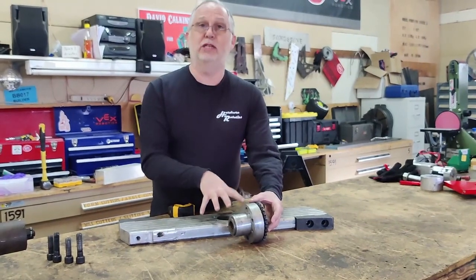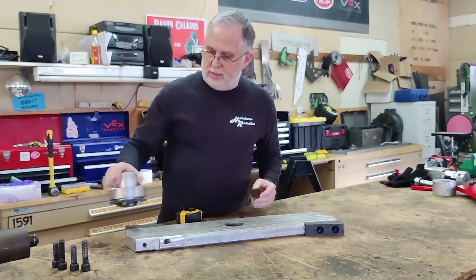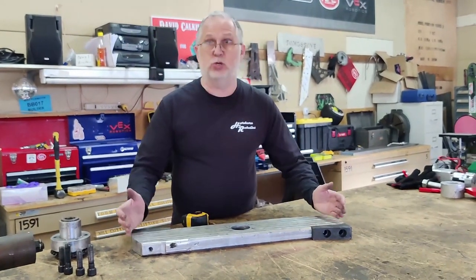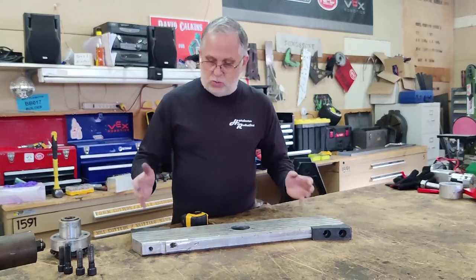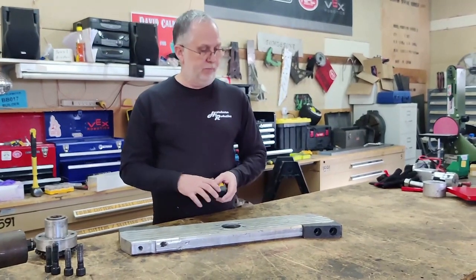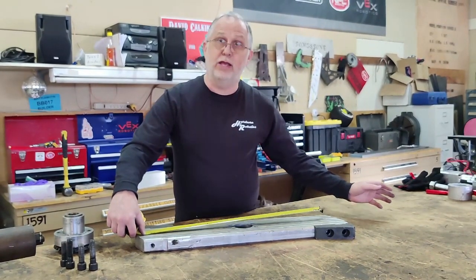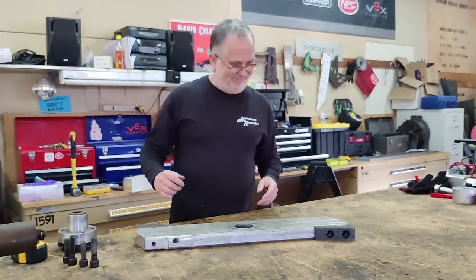We had to make a custom hub to get this all to bolt together, but it all worked and we actually did use this for Mortician way back when. Now with the new design we're going to do for Mortician, we're going to have the weapon bars actually be shorter and spin them faster — it'll still have the same energy, but structurally it's going to have a smaller reach. This weapon bar, even though it's usable, is really going to be too long to fit in the new frame. Right now it's just shy of 28 inches long, and it needs to be 24 inches.